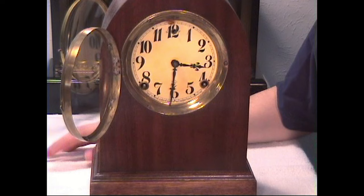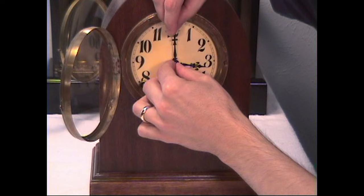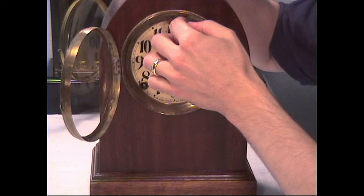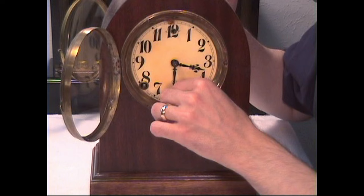Well, there's an easy way to fix that. All you have to do is remove the minute hand, turn it around — and voilà, it shall chime correctly. So at three-thirty you hear the cup bell, and it should chime correctly at four o'clock.